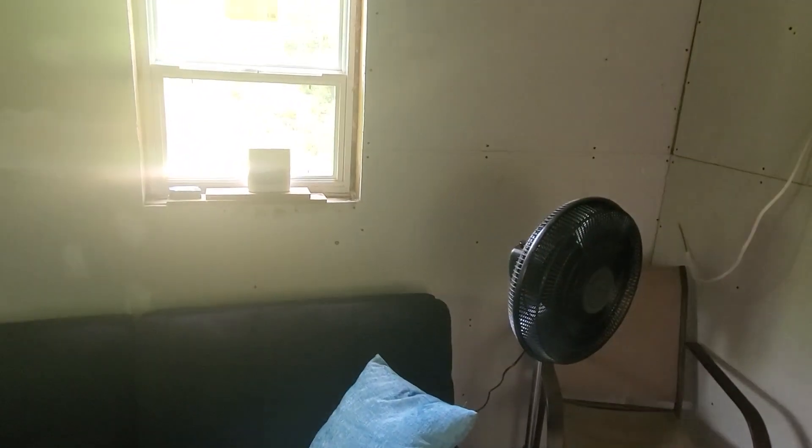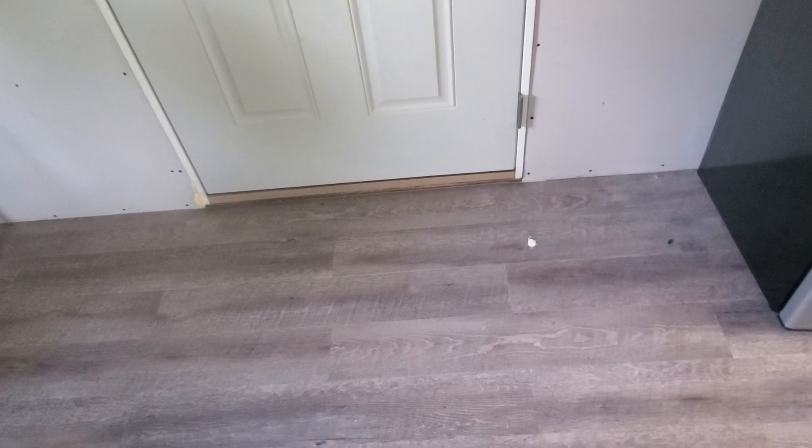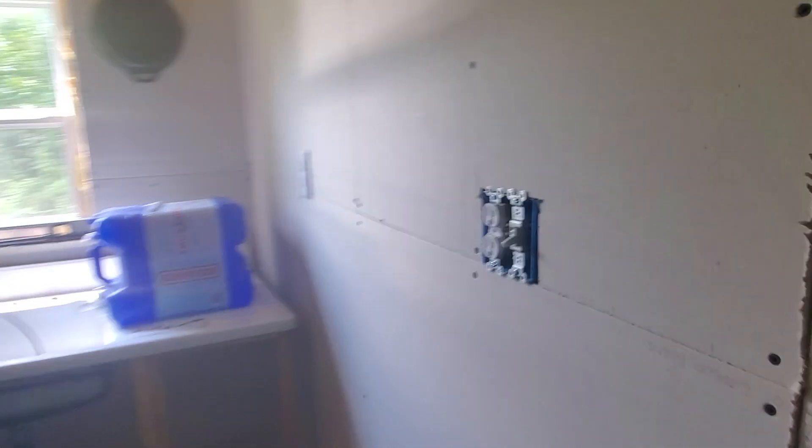The air conditioner is running, the fan is running — you hear the generator on the porch. That was just for testing, but there are no extension cords coming through to plug anything in. Guess what — they're plugged into outlets. See that? There's one back there, and all along here. I came out here and got all the electric set up, and through the service panel my generator is plugged into the receptacle I put outside, and that's energizing my service panel.